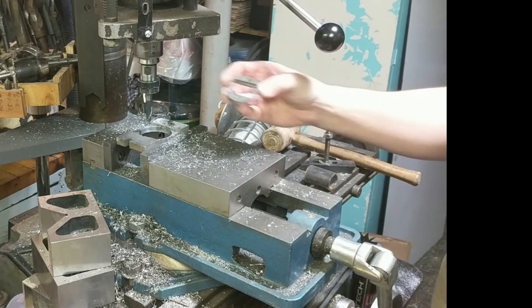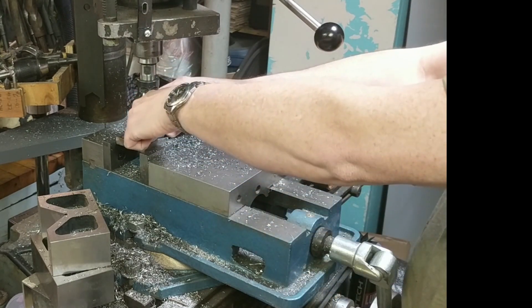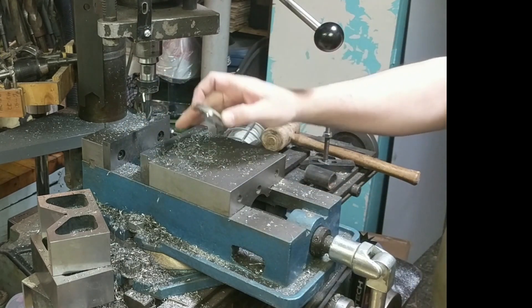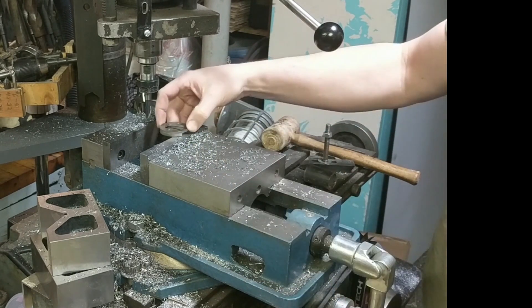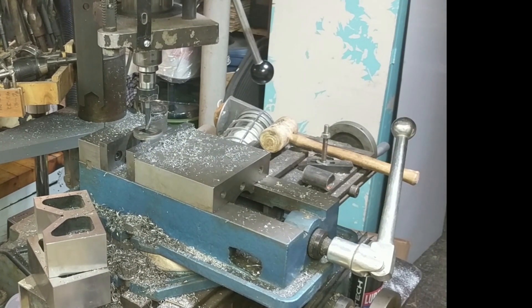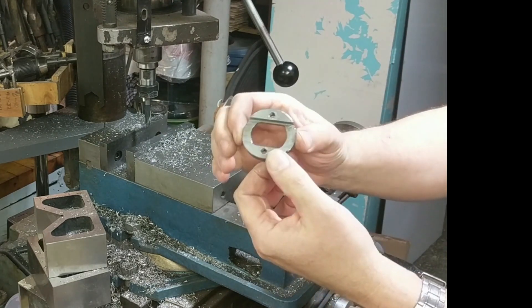The phone battery died — here's what you missed. I finished drilling and tapping the two holes, then set up and ran a 2 inch hole saw down through the center, which effectively cut this disc out. The remaining piece goes in the garbage. Then I took this piece, flipped it upside down so the vise jaw can grip here and make the slot perpendicular to the vise jaws. Gripping it in the vise like so, and using the 3/8 inch carbide end mill, I milled out this slot to the drawing specs: 1.249 inches long, 7/8 of an inch wide. After a bit of deburring, the bracket is complete.